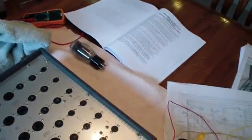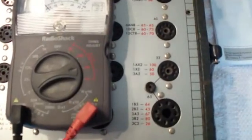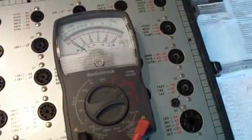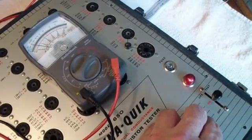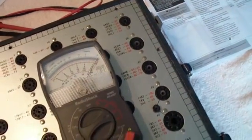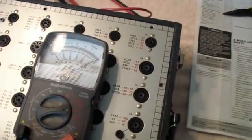I still have the 83 tube removed. I've turned it on with the meter set to 50 volts AC. The power light came on. As we turn the switch up, the voltage begins to rise, and when it gets to the 50-volt position, we read a little over 50 volts — that's because our line voltage here is about 123 volts, whereas this was originally designed to operate on 117 volts, so we're getting a little high.